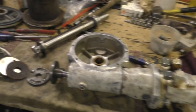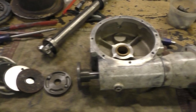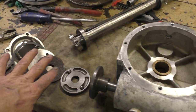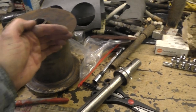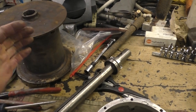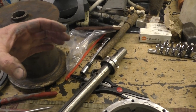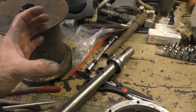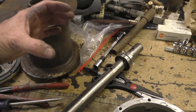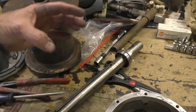Okay, for the record book, here is the documentation on the winch, and I have this brake figured out. This is amazing. Okay, so there's the spool, right? The cable goes over the top of the spool. That's important because the spool wants to go this way when it's being loaded by something out of the crane, and that's also the force direction when it's trying to pick this thing up. It's wanting to go that direction.